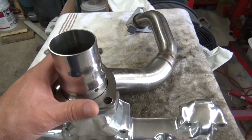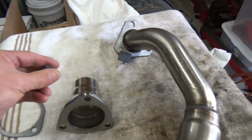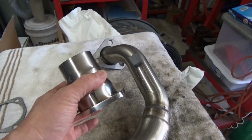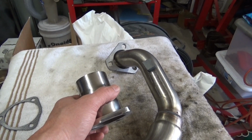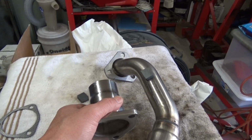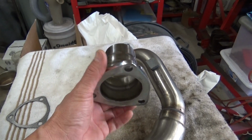So that was my question: this is stainless steel, supposedly. I'm guessing it's more stainless than this, because if you take this magnet, it won't stick to it at all. So my question is, all I've got is a MIG welder. I know they make some wire that is stainless steel, E309 or ER309 or something like that. They say it's stainless steel wire, and it'll weld to carbon, but I think they recommend a tri-mix gas, which I'm not going to go out and buy or rent a bottle for just one weld on both of these.